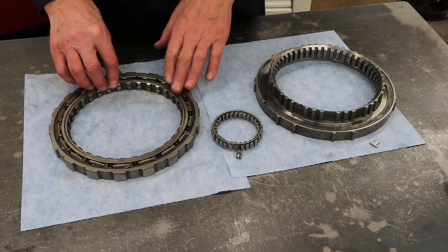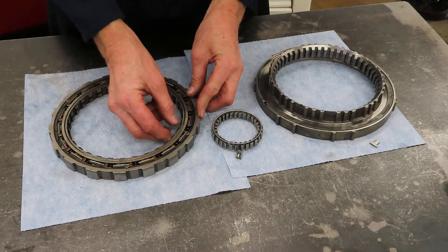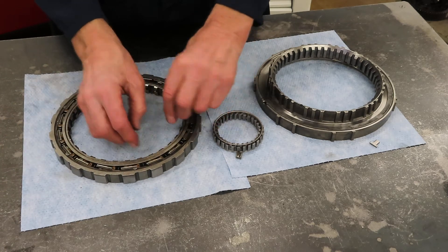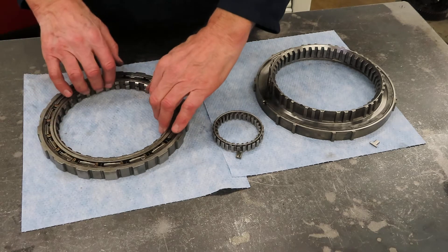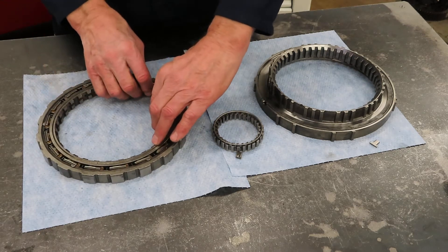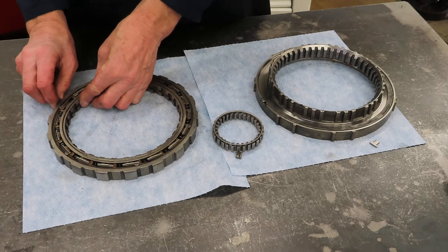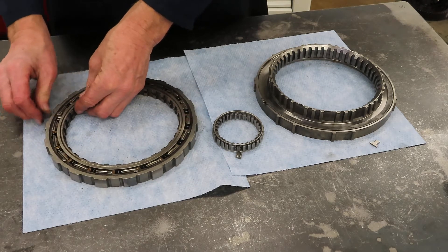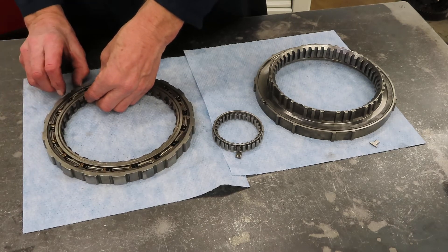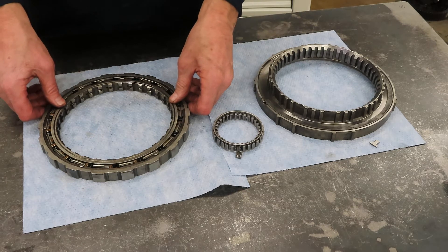Here are the three types of mechanical one-way clutches. A one-way clutch can freewheel one way and lock or drive the other direction. For example, in first gear you're propelling the driveshaft, then you let off the gas and the vehicle keeps rolling — the tail shaft keeps turning, but the driving portion of the transmission is now turning slower than the vehicle's wheels or driveline. You need some sort of mechanical one-way clutch in the transmission or drivetrain for this very purpose.